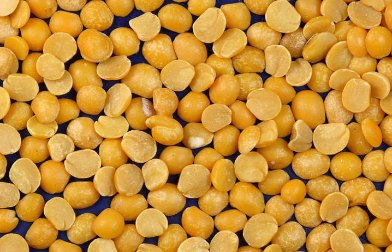Split peas were used for an unusual non-culinary purpose during the Second World War. Great efforts were made to optimise the manufacture of the British Supermarine Spitfire fighter aircraft, speeding and cheapening manufacture while maintaining or enhancing performance. Flush-headed rivets were used on a prototype for the smoothest possible surfaces, but this made it more difficult, expensive, and slower to produce than using the usual dome-headed rivets. Rather than the cumbersome alternative of comparing actual rivets, split peas were glued over all the flush rivets to simulate dome heads. This reduced the speed by 22 mph (35 km/h), which was unacceptable. Split peas were then progressively removed to determine which rivets really needed to be flushed, and the results were applied to production aeroplanes.